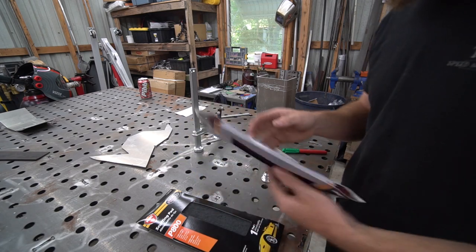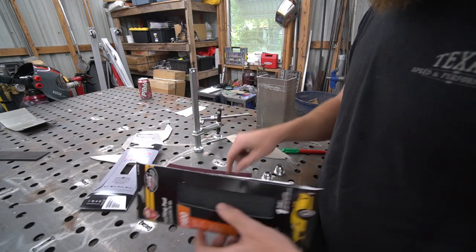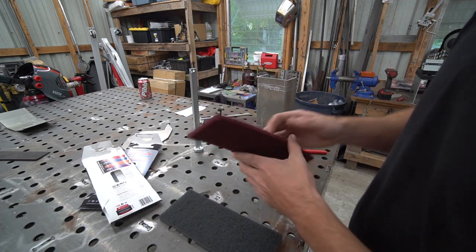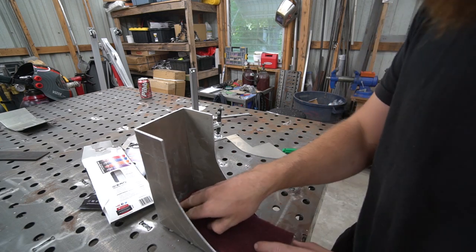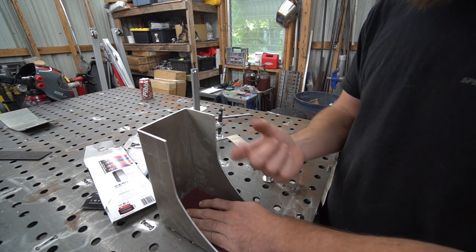Alright, well, I had to go to the parts store to get these, even though I ordered them on Amazon. My Amazon order got delayed, and they didn't have two of the same either. So basically what we're doing with these: one is going to go on the inside here. We're going to have a plate welded over it with some holes, so the oil has to pass through this, so oil can't just splash in.